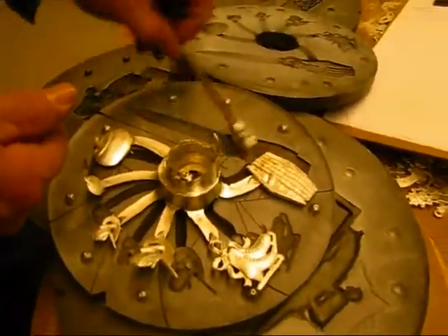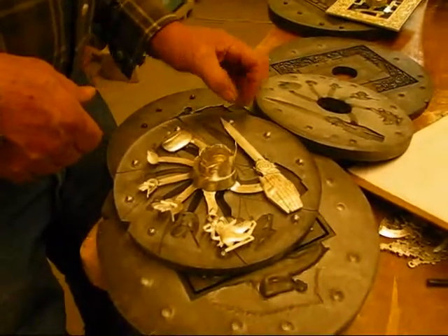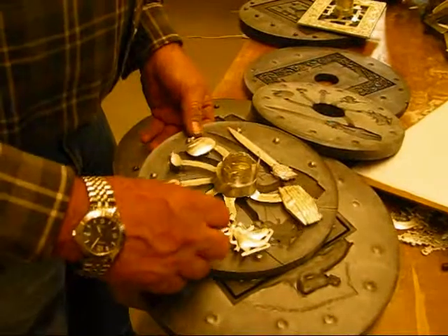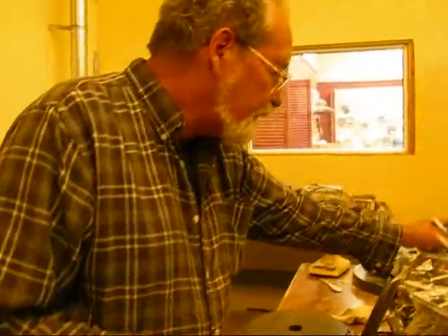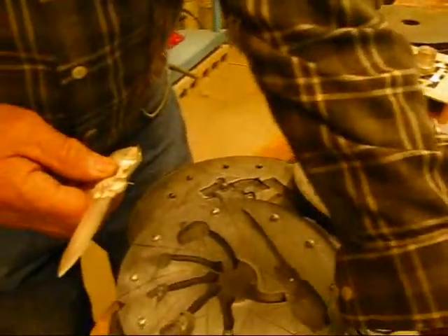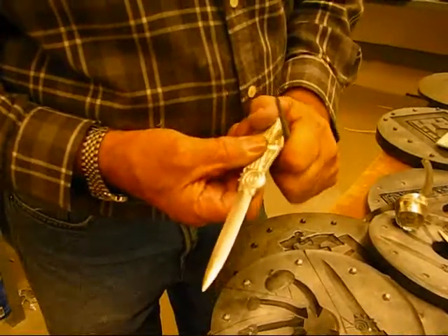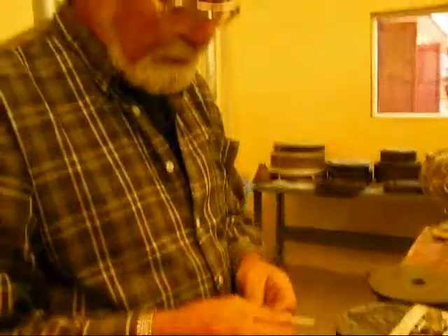So obviously there's got to be a little more to the story. We're doing a letter opener right now for McMaster University — that's their new engineering building. When this is done, you cut the runners off and then smooth it out somehow. We have to break these pieces off, and you can see there are little rough edges. At that point, we'd take a knife or a file to clean them off. Then you look at it and realize it still doesn't look like pewter — it's just a flat white metal. So let's go over and I'll show you the rest of the story.